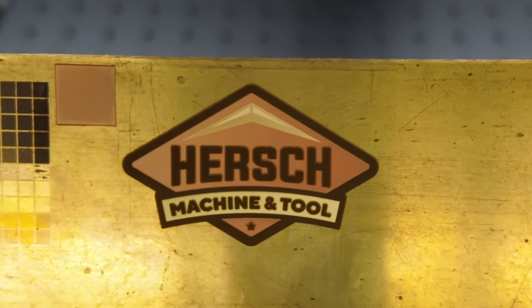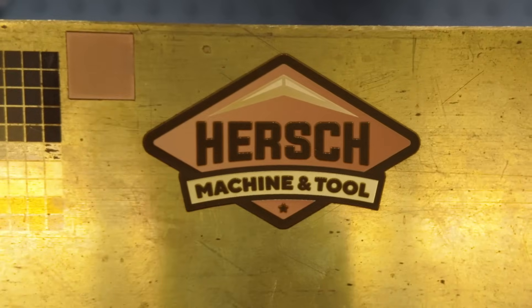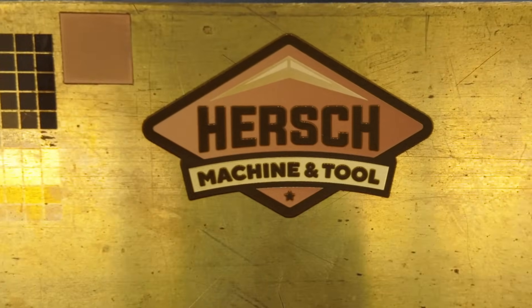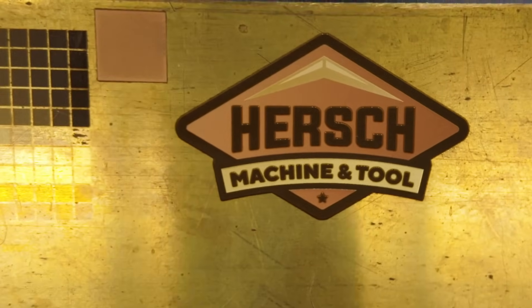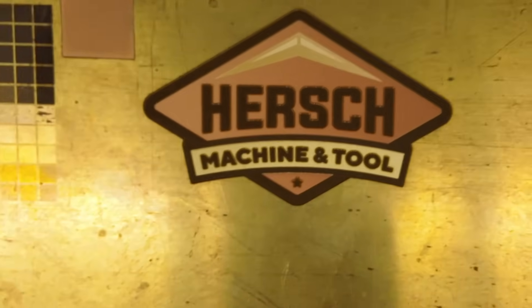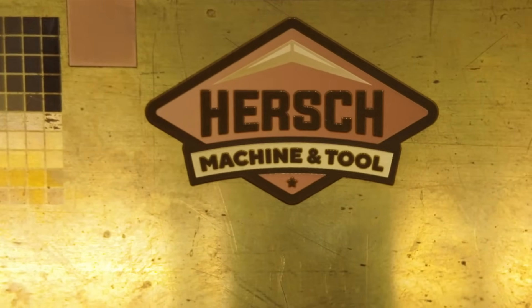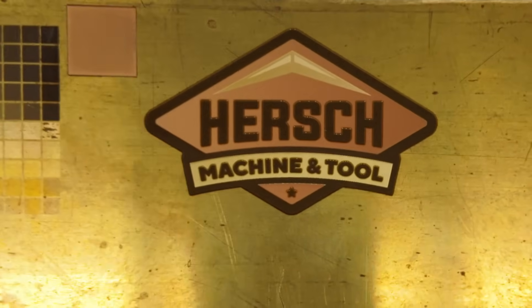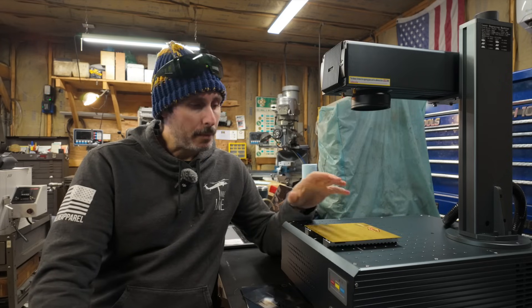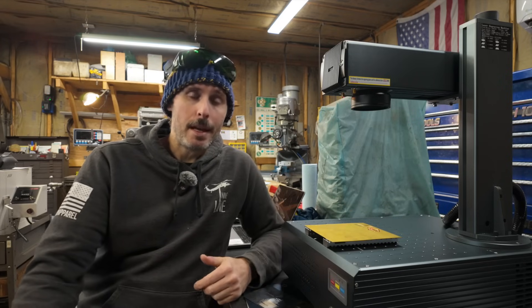The idea here is that by assigning different sections of this logo to different layers with different settings, I will hopefully reproduce different effects, resulting in a multicolored engraving of my logo on that piece of brass. Do I really even need to say anything about this? If you're telling me that that doesn't look absolutely fantastic, then I'm telling you that you might need to get your eyeballs inspected. And keep in mind that I was able to get this result after running a single test grid and honestly not really knowing what I'm doing with this laser. So that's the very basic gist of what a fiber laser can do — it operates on a wavelength that allows it to affect much harder materials like metal, different types of stone, and even diamond.